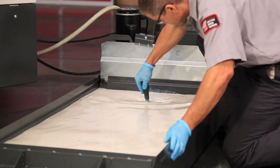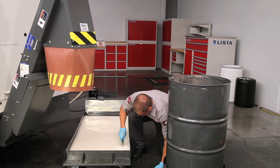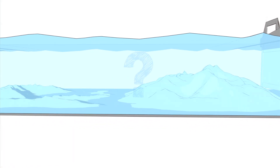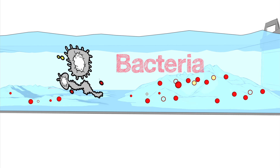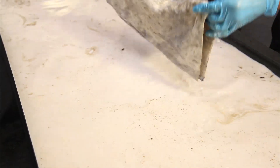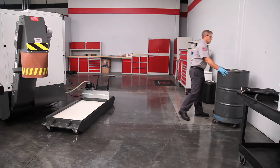Check for chips in the tank using a perforated scoop. Drag them against one wall of the tank and scoop them out. There are a couple of reasons why it's a bad idea to let chips pile up in your tank. When you're topping up your coolant, how will you know how much room is in there? Those chip piles can take up a lot of tank space — enough to make a real difference. They also provide the perfect environment for oil-hungry bacteria to grow.